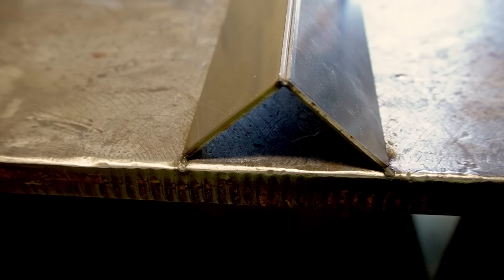The next technique is bracing. You can see here — to keep these two pieces from moving while I'm welding them, I have them tacked to my table to brace and lock them in place to minimize movement. I don't use this method as often by itself because when you cut those tacks to remove the bracing piece after welding, your piece has a tendency to spring up and pull because of that weld shrinkage. I usually try to pair it with another technique as an additional measure to help reduce distortion.